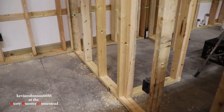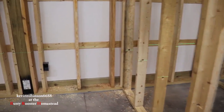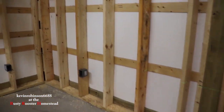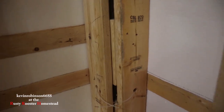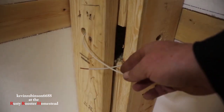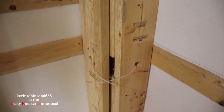Julie's got lots of wood chips here on the floor. We've got tons of holes drilled. We have all the boxes in this room. And what I did when I came to the corner, we drilled across there. We haven't run our wire yet, but I put this little wire in here just so I can hook out to my 12-2 wire and pull it through. We did that to both corners and both bedrooms.